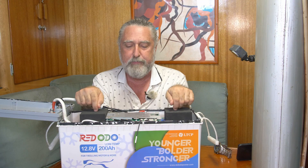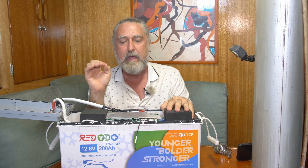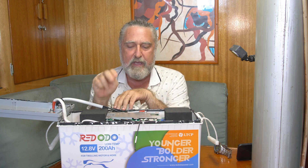The next thing I did — and this is important — is I charged it up with the Bank Manager to 100%, then hooked it to my bench power supply and brought the power up slowly until the BMS shut off. It does that when one of the cells hits a terminal voltage — the voltage should be 3.65 volts per cell, and it was. Then I very quickly went down all the cells and checked their voltages.